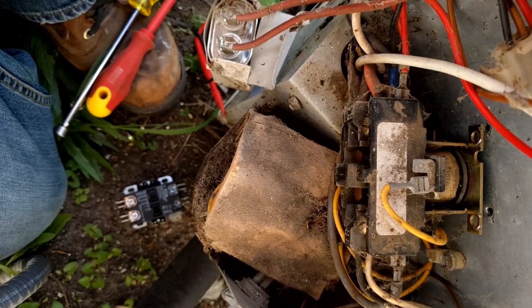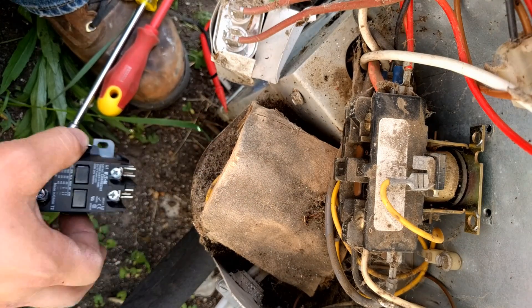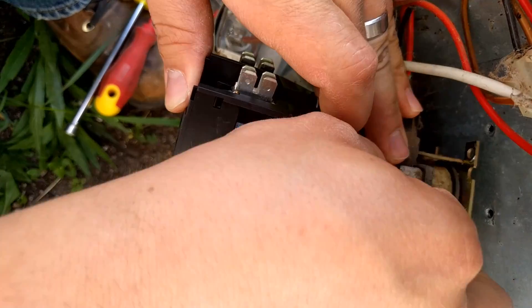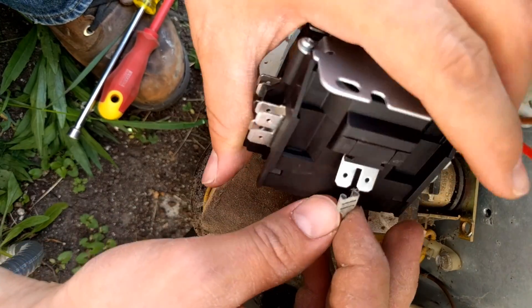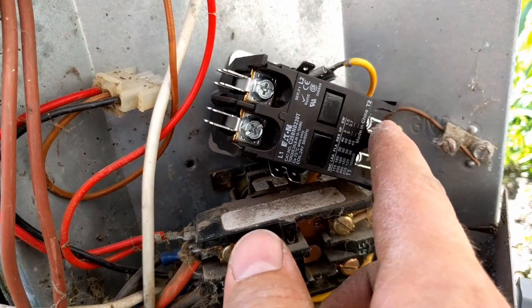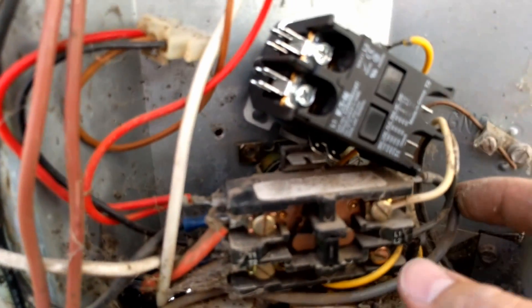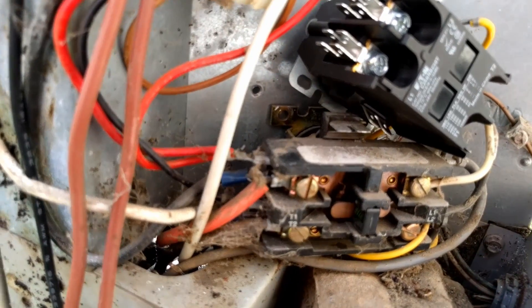Now, there's not actually very much room to get the contactor anchored in place here, so I'm going to do my best to do this. Sorry about the angle — it's difficult to get it just right. We're just going to put this on this side right here. Line voltage coming in — those two move up to here and here. Voltage coming out — those two screws go up to there and there. And then right behind them there are a few plugs. There's one that's plugged down here connected to this terminal — that'll transfer to that terminal, and so on and so forth. Just put them all to the like locations, and I'll show you what it looks like once I'm done.